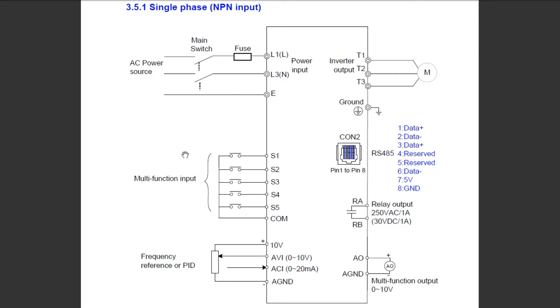Looking down on the left, you can see five push-button switches labeled multi-function input. Each one of these switches can be programmed, so you could have a start switch, stop switch, reverse, forward, or a jog — they're totally programmable. On the right you can see an RJ45 connector, which is an RS485 port, so we could use Modbus and connect this to a PLC for PLC control.